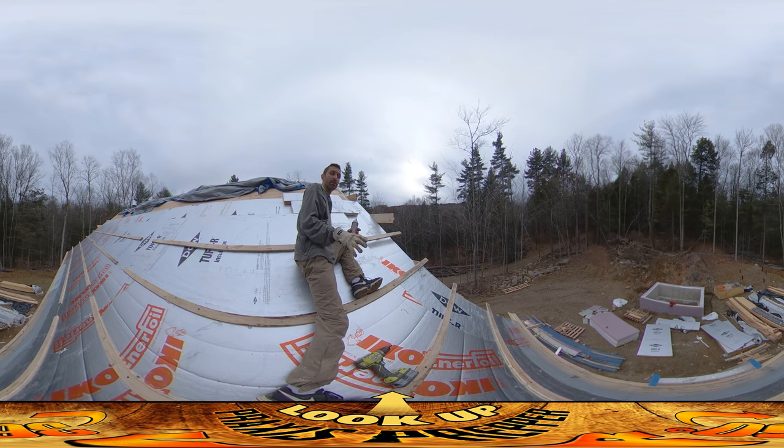The first step, beneath all this, is I've been putting borax down — sprinkling it over the top of the wood and then putting down the sheets on top of that. That's something that'll hopefully prevent ants, termites, and things like that from getting into the structure. It doesn't hurt the wood to put it in there, so I've been putting it in.